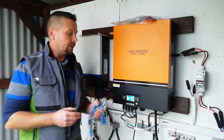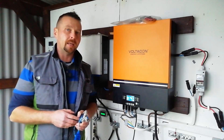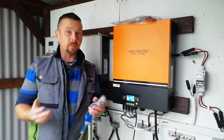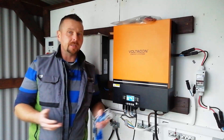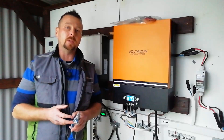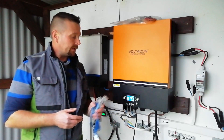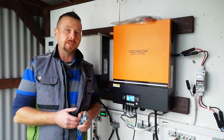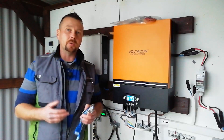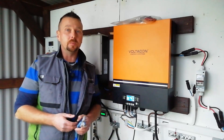The reasons I had to do the reflash on this unit were that it had developed a couple of problems. The first was that it wouldn't turn on on three separate occasions with the sun shining on the panels — so good power coming in and the battery in a good state of charge — pressing the button on and off it refused to turn on. This happened three times over about a week and a half. It was intermittent and hadn't done it since, but it seemed to be a software glitch. The next problem was the equalization cycles — it refused to run them for the last number of weeks. You'd switch it on manually through the menu, the equalization message would flash up on screen, but there was absolutely no change in charge level to the batteries and the timeout wasn't functioning — it would keep the program running indefinitely. It looked like the remote panel was trying to activate the program but the inverter or battery control unit wasn't actually activating it, and it would keep running until manually switched off through the menus.